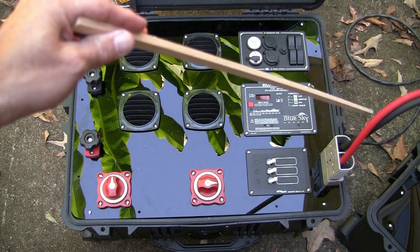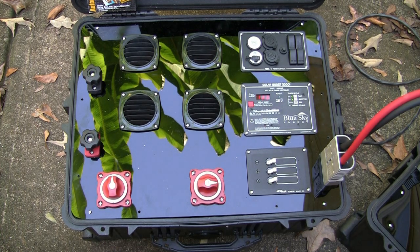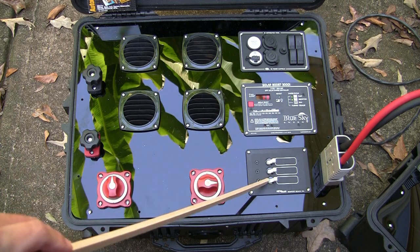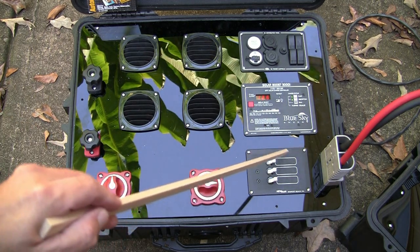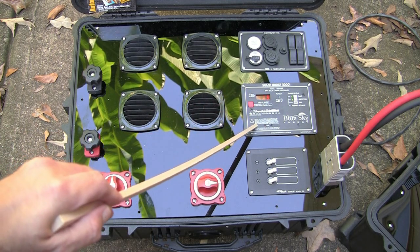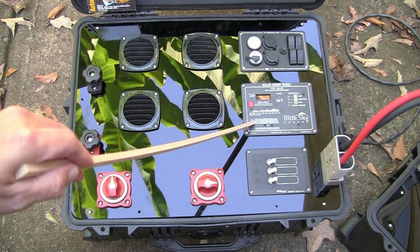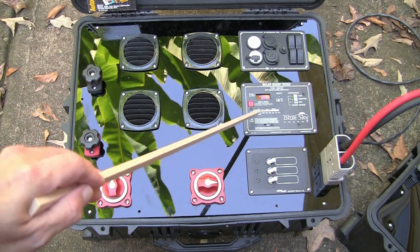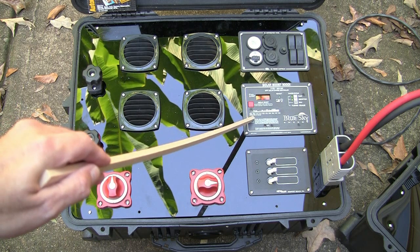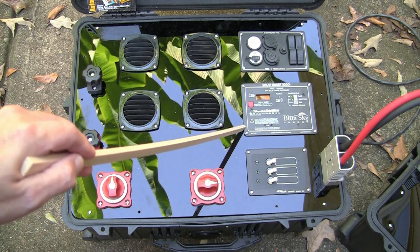That's coming from the solar panels, goes in the side with another one of those funky connectors that I made. It comes into my breaker panel down here where I have 3 breakers. First it comes from the panel through the second breaker, but the first breaker is the batteries because you have to charge the controller. The controller needs some power in order to regulate what's coming off the panels. So you never want to take your batteries down to 0 just because of that. But first breaker goes on, will energize the controller.